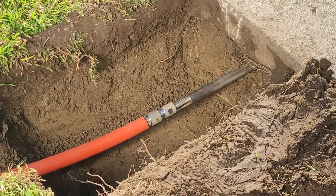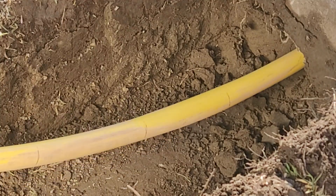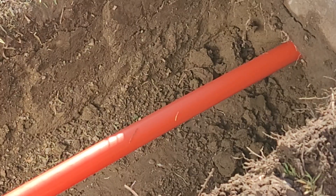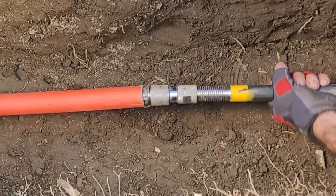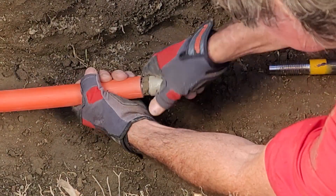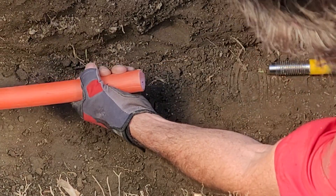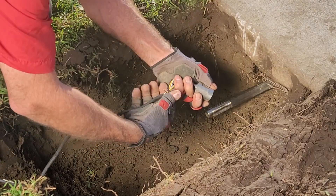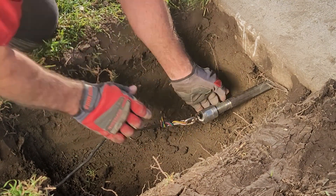Once the pipe is secured to the shaft, pull the shaft out. This process simultaneously extracts the shaft and installs the poly pipe. After the pull connector emerges in the entrance trench, remove the pull connector and continue installing your pipe. Note that with the D-ring pull connector, installing wire or cable under a sidewalk is a breeze.